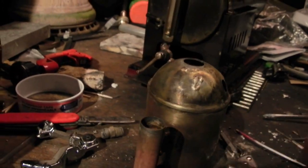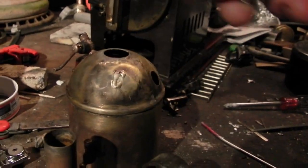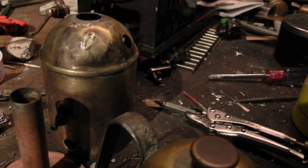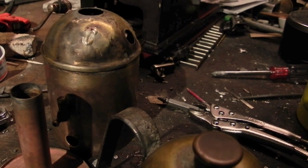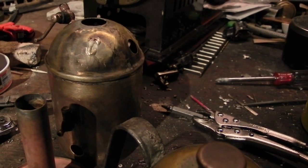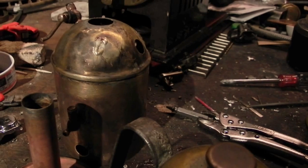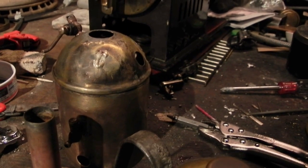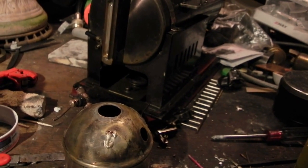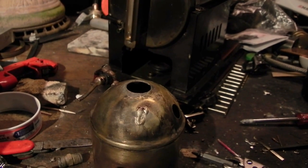That's the progress on the donkey. I've got a little bit more work to do on this engine. I got easy outs, but they are too large — it's the smallest one I could find. So what I'm going to do is try to tap the drilled-out bolts that are there and gently use a good tool steel tap, a metric tap, to cut through the steel and the brass. The tank is likely brass, so it'll tap quite easily. But the remains of the two bolts that are there might be a bit of a difficult tap, so I do want to use a hardened steel tap for that.